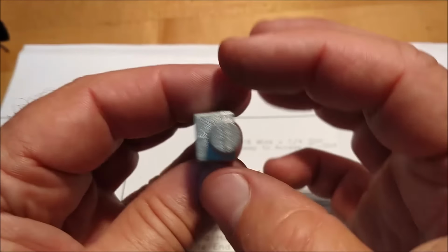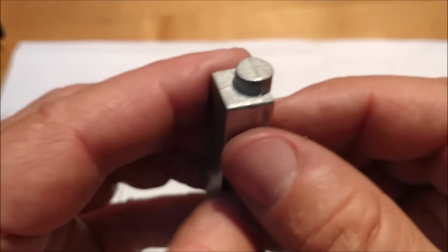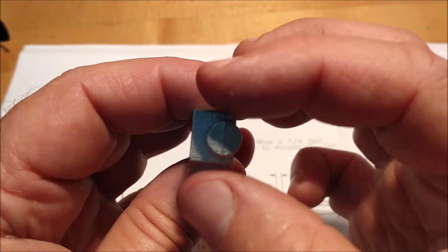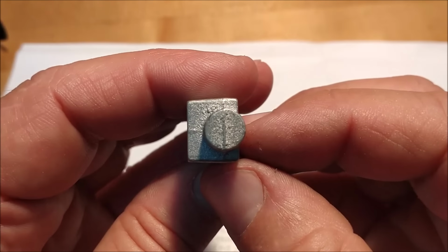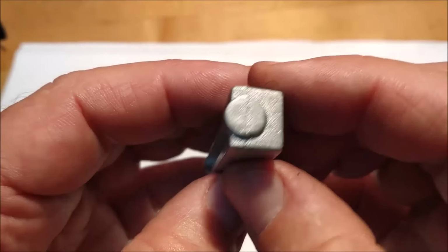and then I'll measure from the sides to the boss as soon as I remove those flash lines. And that will give me my amount of material I have to remove to center up on this boss and keep the width within tolerance. Let's do it.